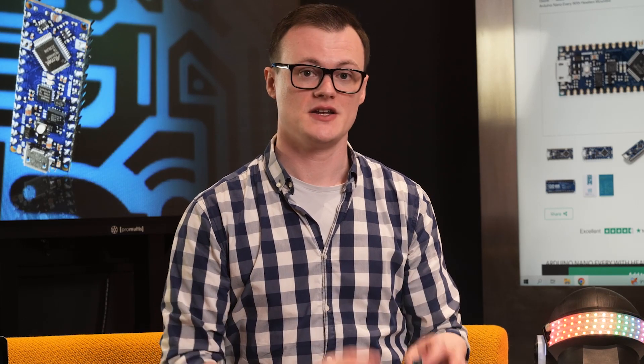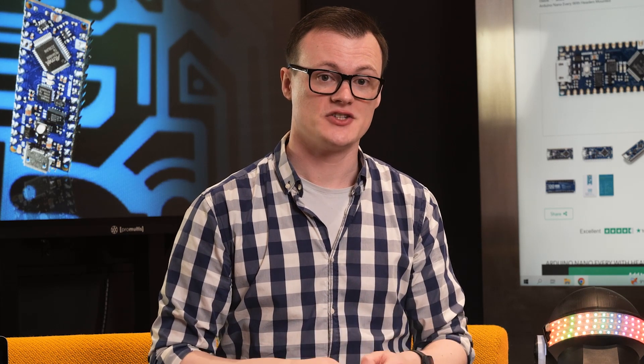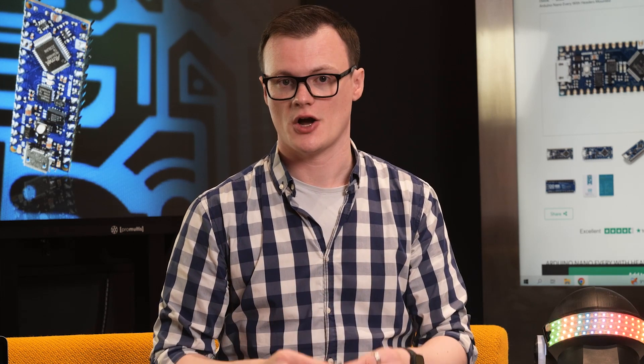Basically a really, really tiny FPGA, the ability to operate TWI in both master and slave configurations simultaneously, one analog comparator, CRC code scanner to ensure program integrity, and interrupts on all GPIO.